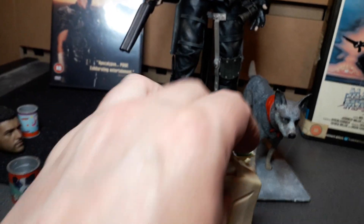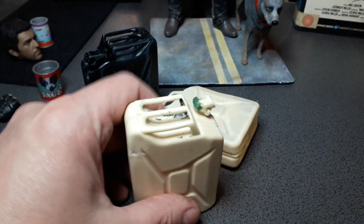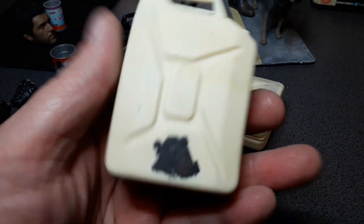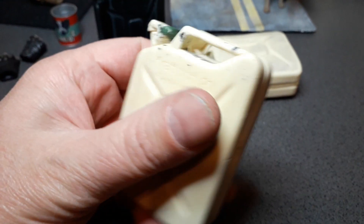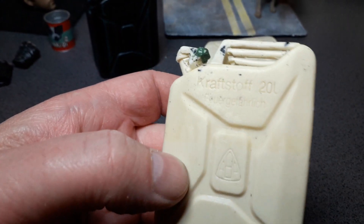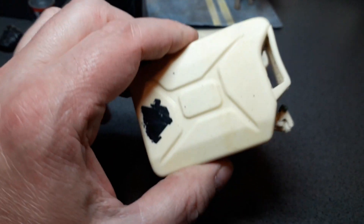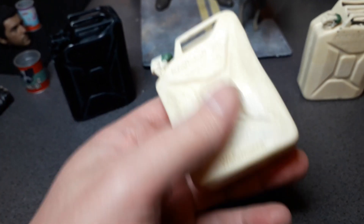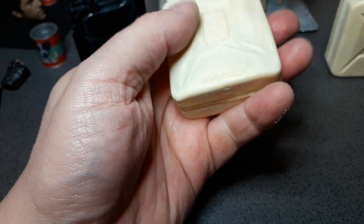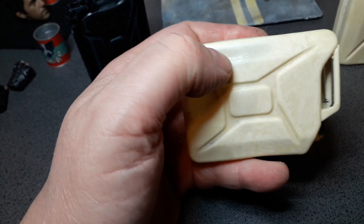This one weighs about the same — slightly heavier. That one is solid. The paint transfer came off that one. This one took about 200 grams of resin but it came out a nice, clean cast, and I added a few air holes in the bottom for filling. Not really cost effective making these. This one I've done by rotocasting — made the mold, poured the resin, and just kept rotating it. That's why it's a little bit uneven and thinner in parts.